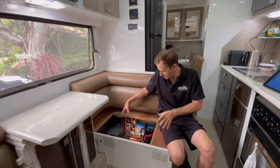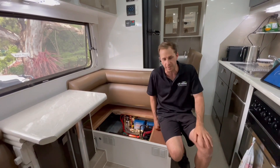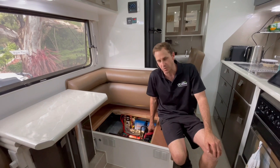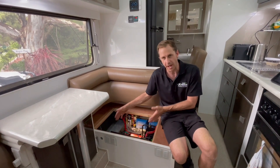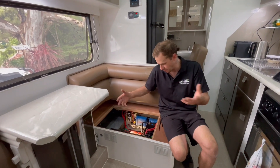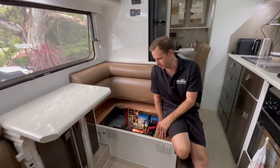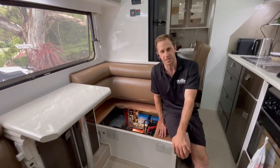What's really cool about this one is it's a start-out-small setup with the option to add another battery. This is a single PowerPore battery — just a single 280 amp-hour scout. This can discharge 250 amps continuous, so what that means is I can run this inverter at 2,600 watts from one battery. You're probably thinking one battery, 280 amp-hours — that's not a lot of capacity. You're right, it's not, but with 1,000 watts of solar on the roof, I can fill this battery up in four hours. That's insane — that's a lot of power.